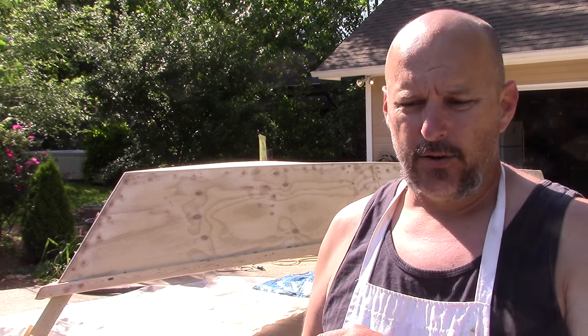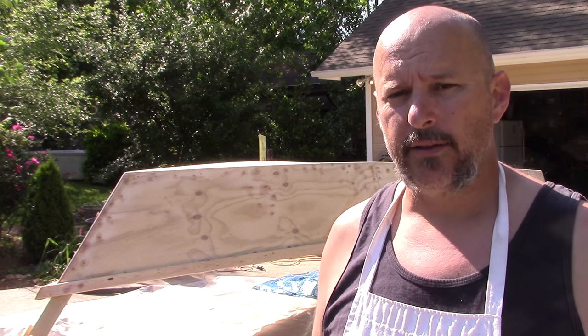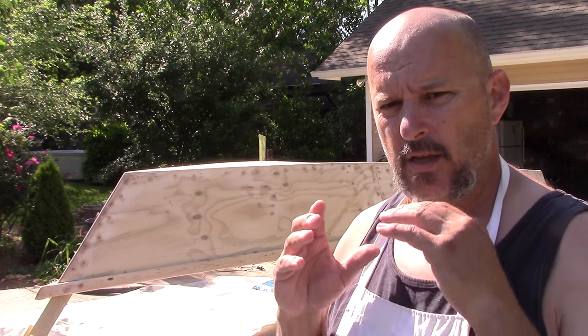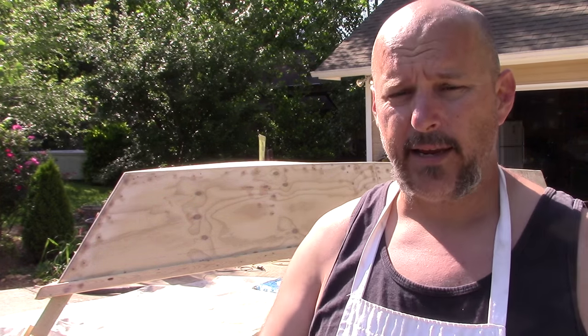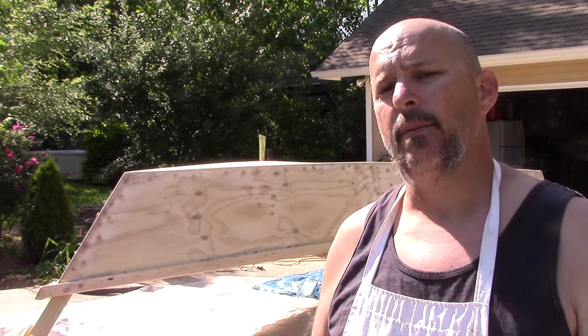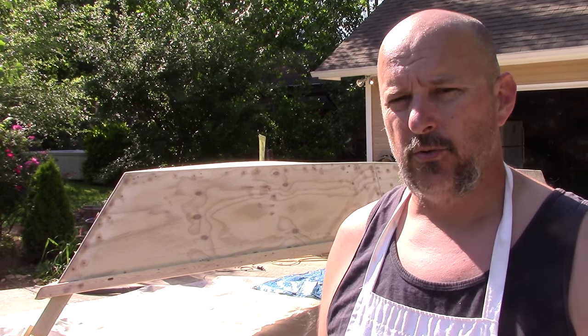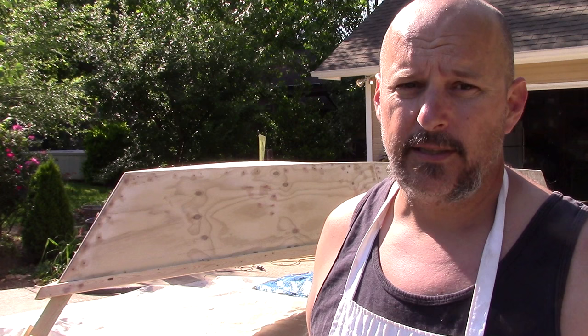—and go to epoxy it again, it's not leaching the epoxy out of the glass, leaving my glass dry and unwilling to laminate. So I'm going to epoxy the wood, let it set until it's tacky, then roll my glass out on it, and then epoxy the glass.